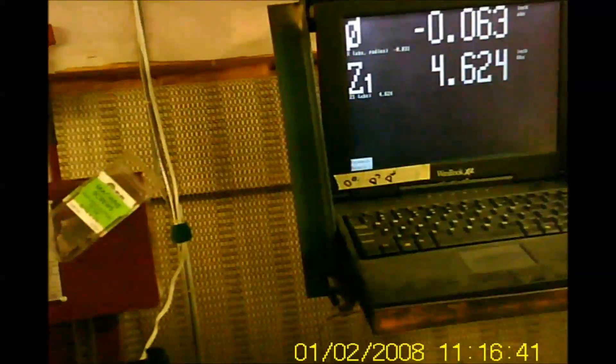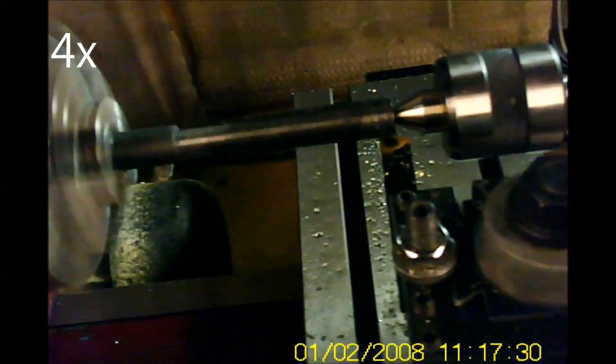Back off 10. This time I only want to go slightly past the end of that weld. Apparently there's a high spot right there as compared to right here — we're going to take quite a bit off in order to get this trued up. This is the tail end of the receiver; nothing bolts to it, it just needs to hold the split shut, so I'm not too concerned about taking off a bit more.